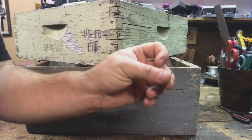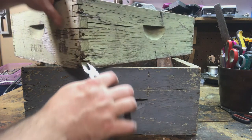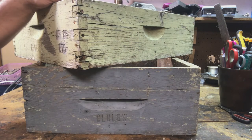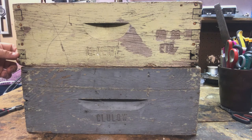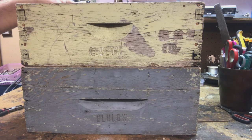That nail is pretty similar to the nail that my other hive came with. Now this box has an excuse — it's getting close to 40 years old. So it can have some loose nails, but they really don't take that long to get loose most of the time. So a lot of what we're going to do with this stuff is just fix some wood. Some of it will need new fasteners of course. Some of the teeth are just a little rotted, and we can solve that. I don't think we need to patch the teeth, but we definitely need to glue and clamp them and get them nice and strong again.